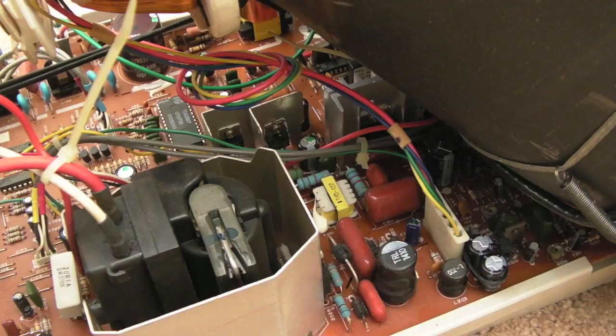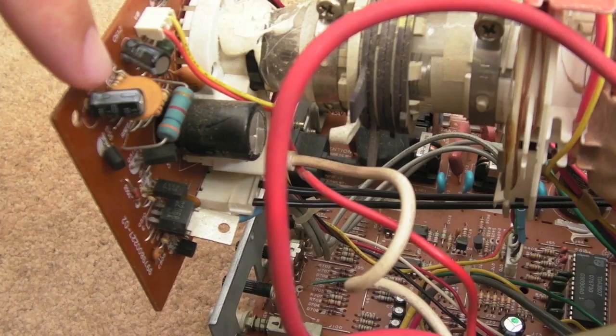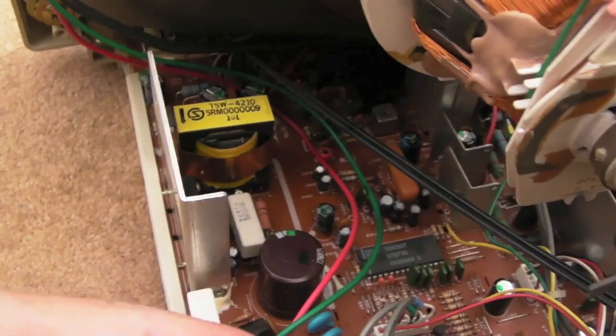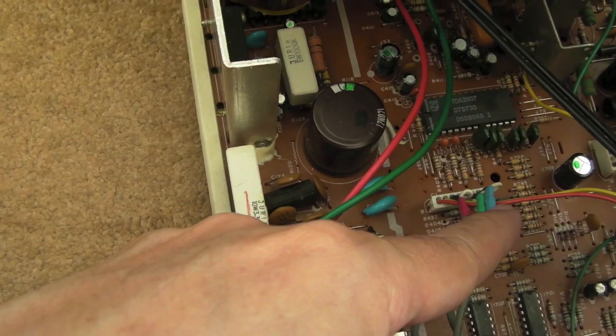So it could still be a cap around there. I'm also going to swap out - I've got a replacement for this cap here and I'll probably remove these as well, so I'll do those three probably next. We'll just retest and then I'll do some of the other stuff to do with cooling to see if we can identify a cause. The other thing I was thinking of doing - can you see where the colour inputs come here - you can see they've got heat shrink around them that correspond to the colour - so we've got blue, green and red.